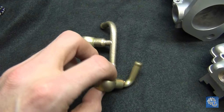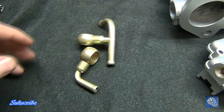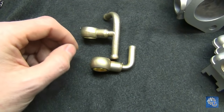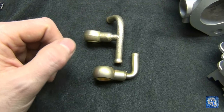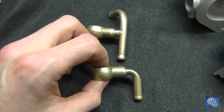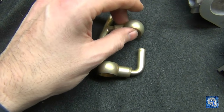Here's how the parts turned out — pretty nice. This one turned a deeper gold color after I cured the chromate on it. I have my coal stove going, putting out a lot of heat — it's only about 20 degrees out. The air coming out of the stove measured approximately 140 degrees. I held these parts in front of the stove for about five minutes to cure them, and that deepened the coating and hardened it. You can use a hair dryer too.